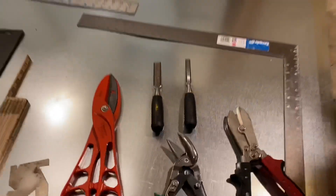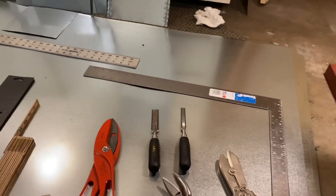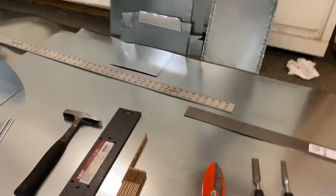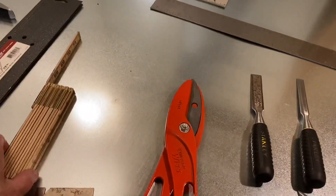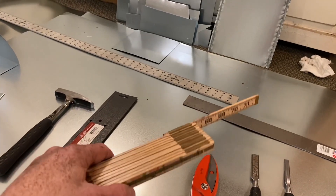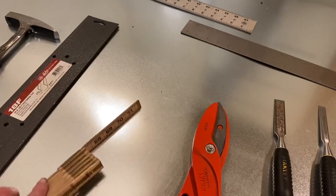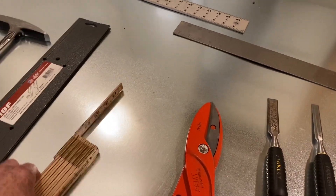I've got my 90 degree elbow. Down there on the left you can see I made my makeshift scribe with a quarter inch, half inch, three quarters, and a one inch. And then of course there's my engineered ruler. I couldn't get inside scribed numbers but it worked really well — I like this much more than a tape measure when laying out the metal work.